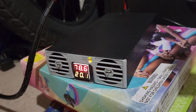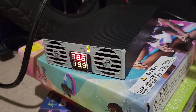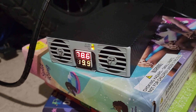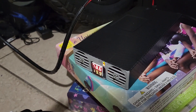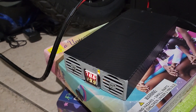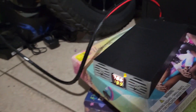This is a bad charger — in a good way. If you want a decent, damn good charger for the price, get this one. It's $108 but after taxes and shipping it'll come to around $137 or so — still worth it, and cheaper than the so-called name-brand charger that looks similar. Like I said, this charger is user-friendly. All you gotta do is plug it in, let it initialize, plug in your charging cable with your voltage and amps already set, and let it go. Once it reaches the set voltage, the amps will trickle down, indicating it's almost done charging.